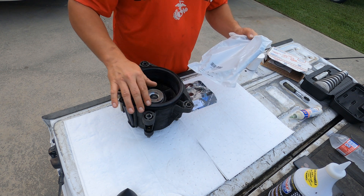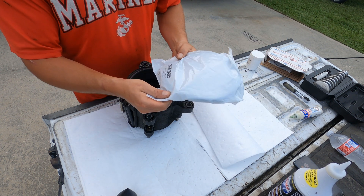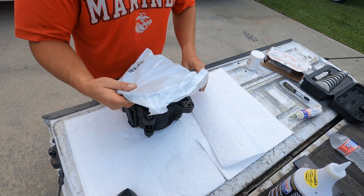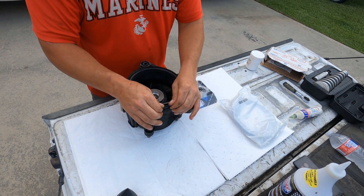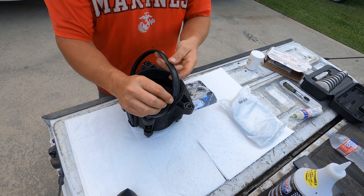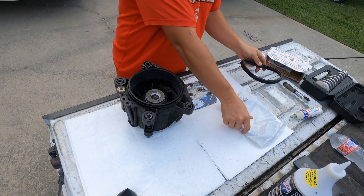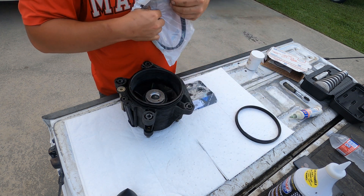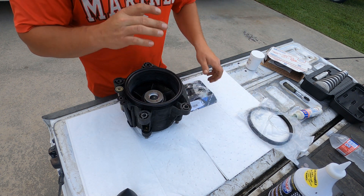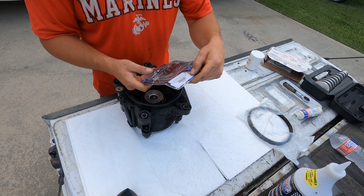This is the seal that actually goes against the ski itself, and that part number is 293-2000-51. That seal pulls out to change it. See how I took it off — the lips facing up, flat part facing down. I'm going to take this new one out. Next is the rebuild kit from SBT — that one is part number 72-109.